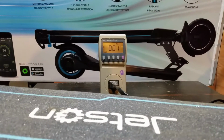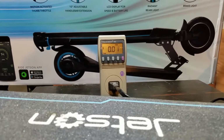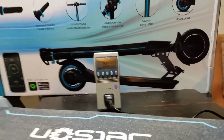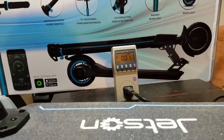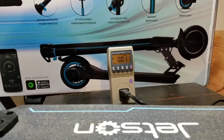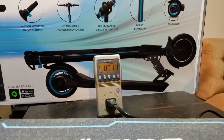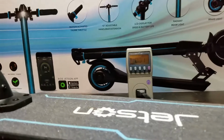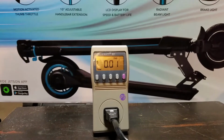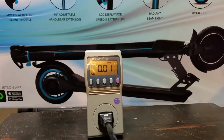So think about this. This is according to Chicago rates with tax and fees included, so that's approximately 15 cents a kilowatt hour. Sometimes it's a little closer to 13.5 cents. If you want to argue with me down in the comments below about how much electricity is in Chicago, realize that I am including taxes and fees and rounding up to the nearest 5. So it's 13.5 cents usually with taxes and fees, but we are calculating our cost at 15 cents per kilowatt hour. And if we're only using a little bit of energy, 100 watts or so, we're looking at a penny.